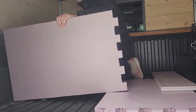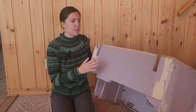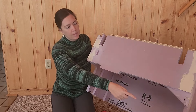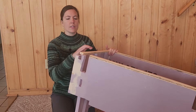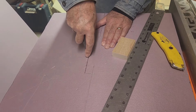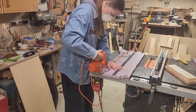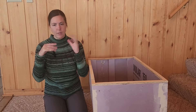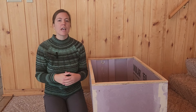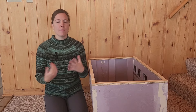Since I was convinced it was going to be strong enough to hold my weight, I went out to the truck and got some of the shaping done — really just stenciling and shaving edges. You can see the spaces for the mounting clamps cut out, where the little metal ring for the tie-down straps goes in, and the shape of the wheel well shaved out and around. There's also space so it recesses underneath that lip at the back of the truck. After some measuring we tried using both a utility knife and a jigsaw to cut the foam. The utility knife worked pretty well, about equal to the hot knife. The jigsaw actually worked great — it created a little bit of foam shavings but not as bad as the table saw, and you could get more intricate edges with a more even cut than I was getting with the hot knife. Feel free to comment below if you use a different type of hot knife that worked well for you, but for me I like that jigsaw.